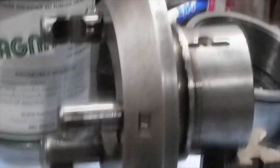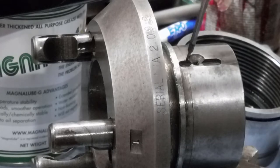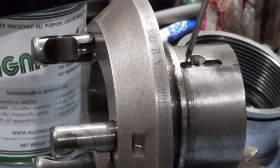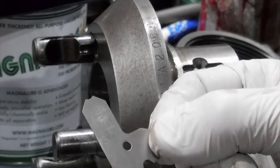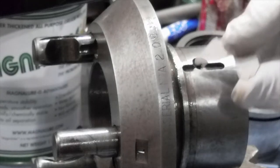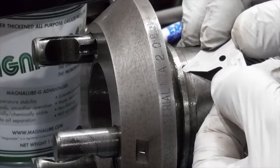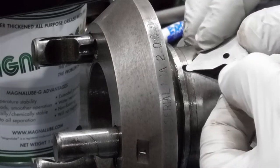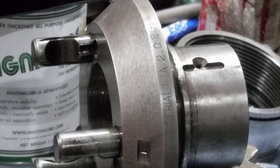We're playing around with the key right now. One element I need to deal with is that this is cut like a machine key — in other words it's not square, it's got a rounded edge. I'm thinking, how am I going to match that up? Wait a minute — radius gauge. A 3/32" radius gauge — or pretty darn close. So it's going to give me the radius I need to go in, and then I'm going to add the radius directly onto the face of the key.